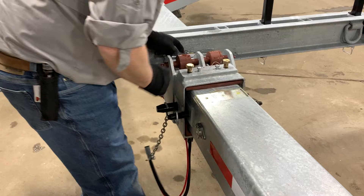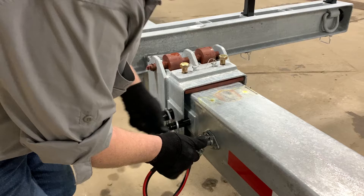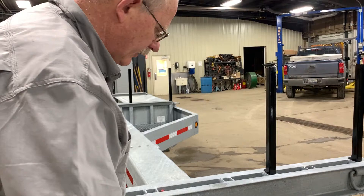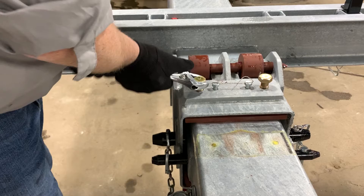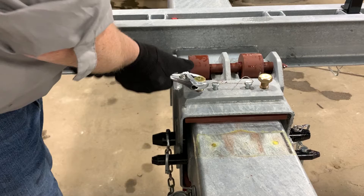Taking care of our position, our pin goes back in. Now our trailer tongue is locked. Make sure that's in there and the cap lock has caught it. Before we drive away, we're also going to need to check all our lights and brakes to make sure they still work — that should be done for every plug. Once all that's done, we retension our jam plates at both places. And that's it.